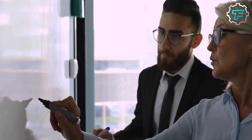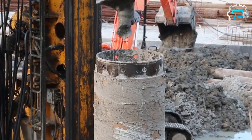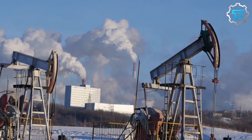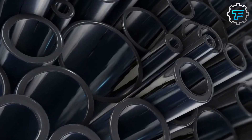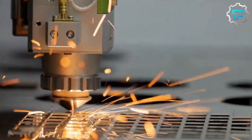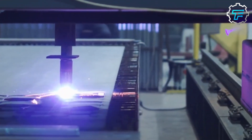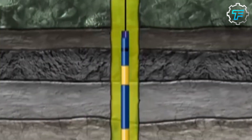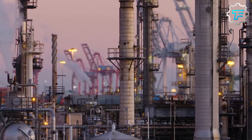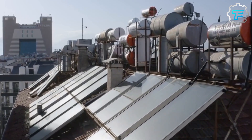The drilling of the wellbore is a complex and challenging process that requires skill and experience to successfully complete. Once the wellbore reaches the oil deposit, the next step is to insert a steel casing into the hole. The casing, typically made of steel or other durable materials, is lowered into the wellbore and cemented into place. Its purpose is to support the walls of the well and prevent the oil and other fluids from escaping.